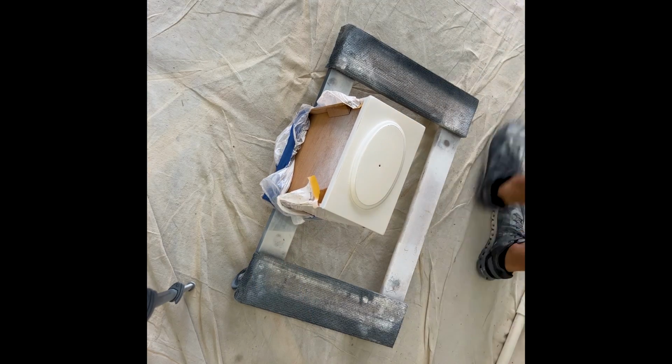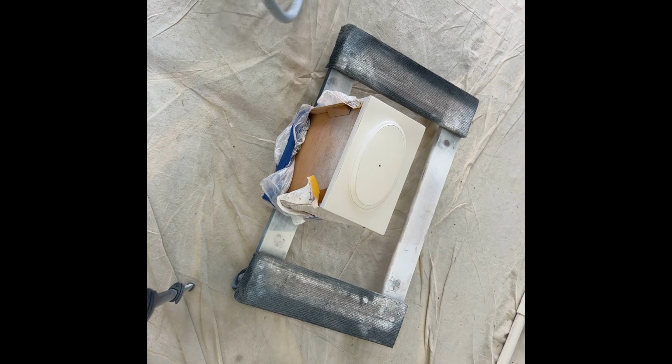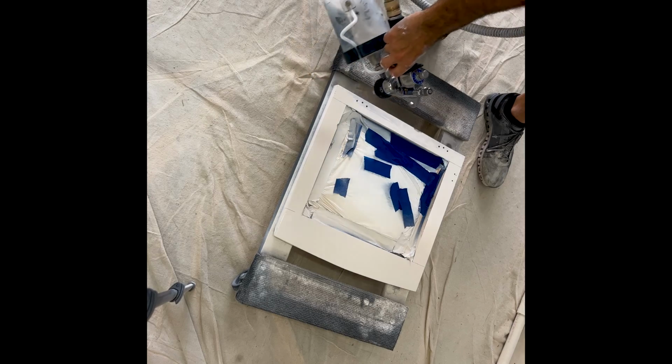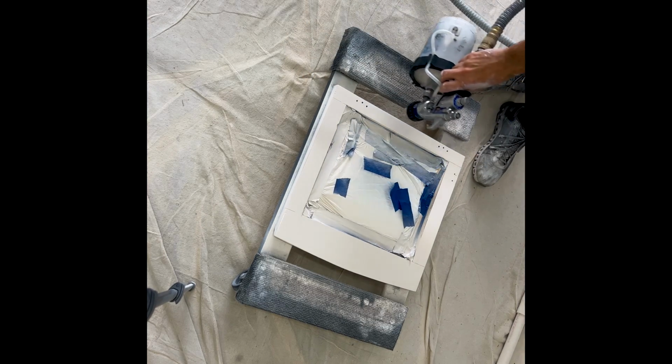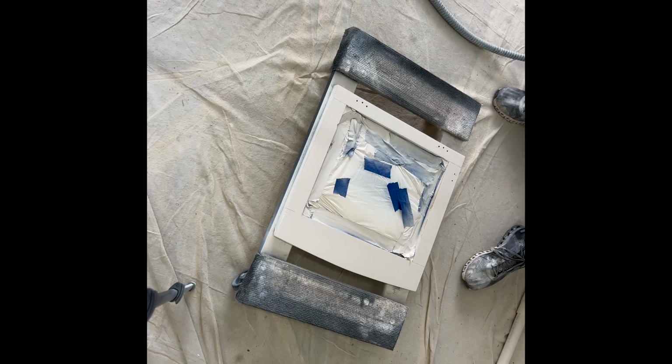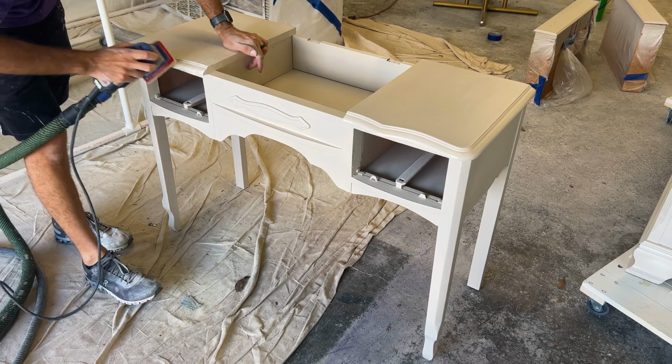It's all going to be different. But I think that anywhere between 3 to 5 generally for most coatings is probably going to be a safe zone where you know that it's going to dry in a reasonable amount of time, but at the same time, you're going to get a thick enough coating for you to work with.